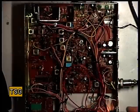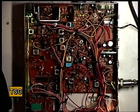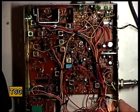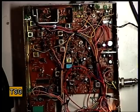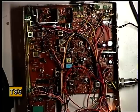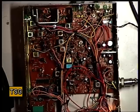I've made myself a little chart. I've only got time to do the transmit side of this evening, so we will start on that now. I can't do the VCO on this with you because I don't have a full manual, so we'll assume that works because it's in lock. It is now transmitting and we will do a tune-up, subject to me finding the tools.